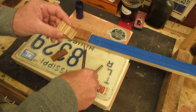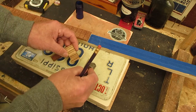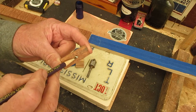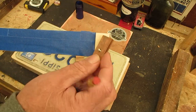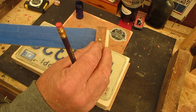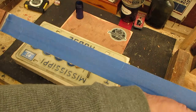I want to take a small bit and drill a hole through there. Then I want to take a countersink tool and countersink the hole. Because what I'm going to end up with is this piece of fingerboard with a screw on it. Now, the reason I countersunk it is when I attach this down to the other end of the neck, like so, when I screw this down, it can't be sticking up over this. It's got to be smooth with this. So when I put this on here, suddenly, you see here, I've got the other side of that, and my fingerboard doesn't bounce around on the router table.